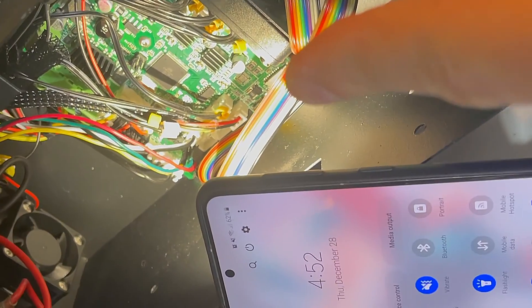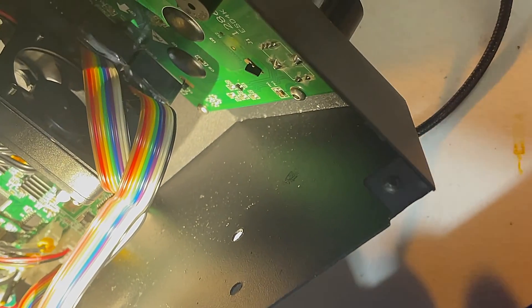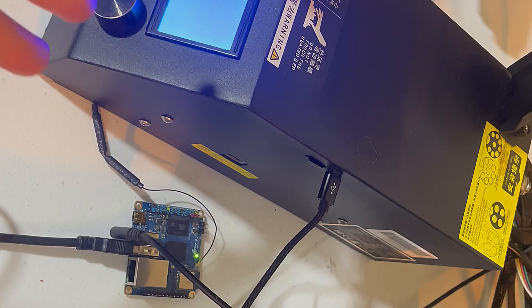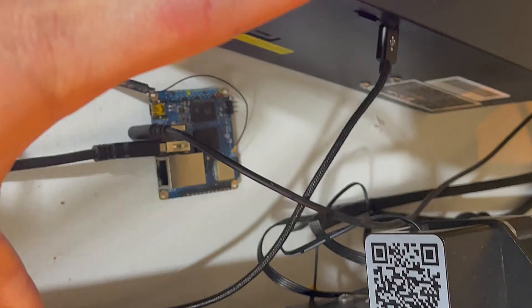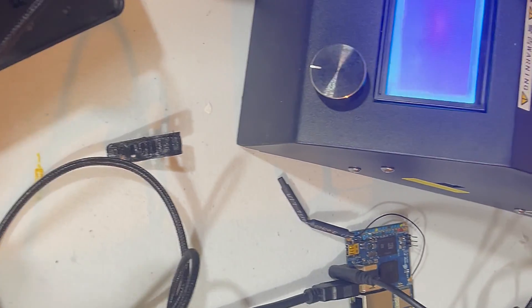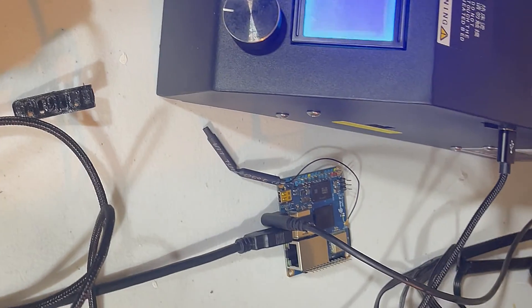I don't think I can compile it with the SD card to flash. I actually just connected via USB and flashed it that way. It's now flashed — blank screen. I had to do that via USB, not micro USB. I set it back to the ATmega 2560 and then flashed via USB with the only USB item connected to my Orange Pi Zero 3. Now it's just to work on the configuration.